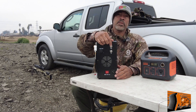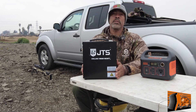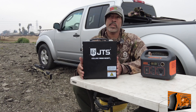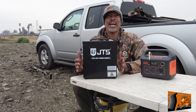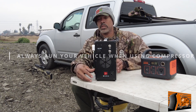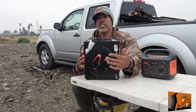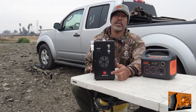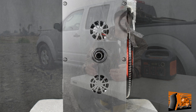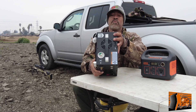Right here you have your start and your off. When you plug this unit in, you will hear a fan come on — that is the fan on the inverter that always stays on as long as there's power in the unit. I highly suggest, and common sense should tell you, if you're running something like this it draws a lot of current and amps. On this side you also have the fill whip, the DC cables, and the 110 power input. There are multiple fans cooling different things: one cools the inverter, one goes to the piston up top, there's an exhaust fan, and fans on the side and top.